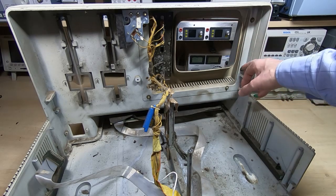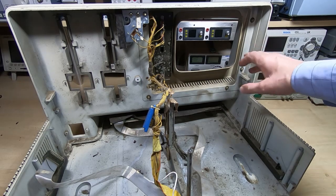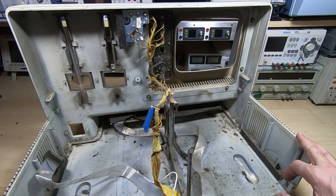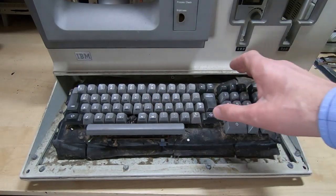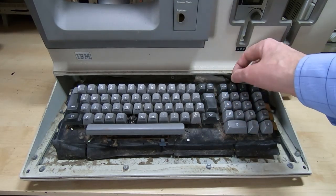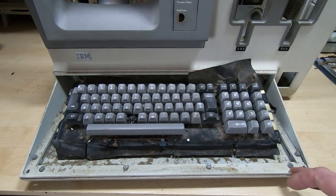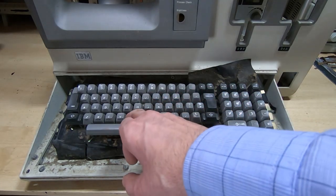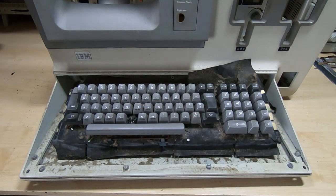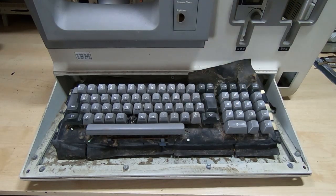I won't remove the bezel because it's held on with a little spring clip — if you try to get these off, you'll most likely snap the plastic posts off the bezel, and it doesn't need to come off anyway. Once stripped down, I'll take it into the workshop and get it cleaned up. Inside the keyboard it's just as filthy as the rest of it, and I'll need to make up a new dust sheet as this one's going to disintegrate. We'll have a close look at the keyboard in another video. Incidentally, if anyone knows where I can get a B key from — we've got a key missing — please leave a comment.